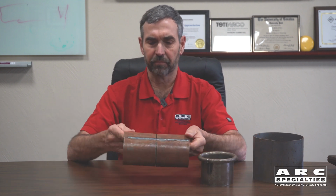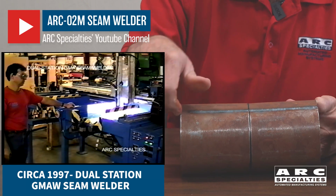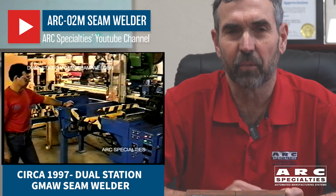This was the solution. You start here where it doesn't matter, weld all the way on, and you can see this is actually two parts, all the way from this part to the second part. So in effect, your second part becomes a runoff tab. I thought it was brilliant, and it works well.